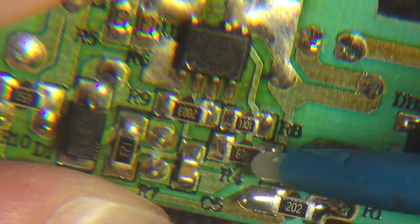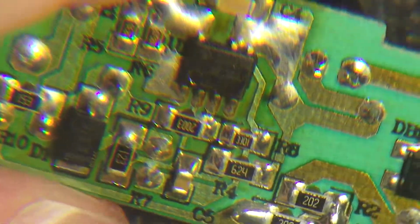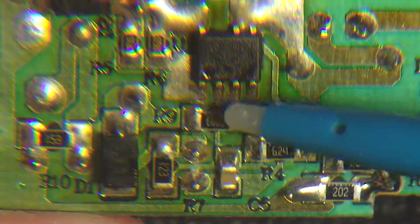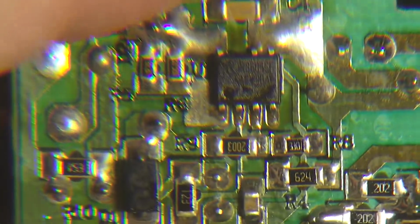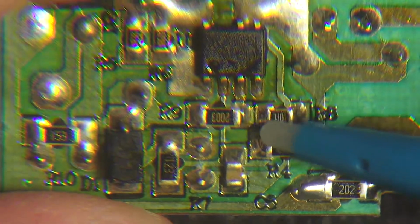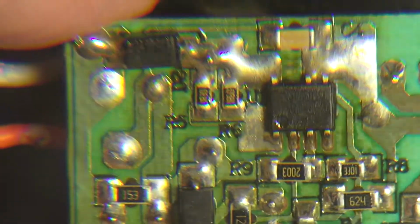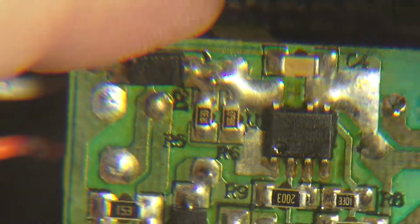It's definitely just been glue dotted down and then flow soldered because of all the through-hole components on the top, and it looks pretty messy. I'll visually inspect it myself because I can't get the focus on the camera quite perfect like I usually do, and see if there are any obvious problems, but really I'm sure it's just a strange combination.